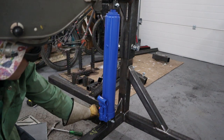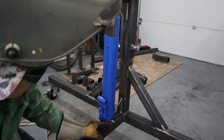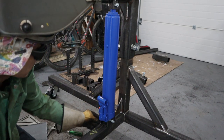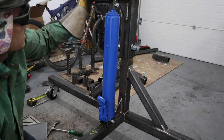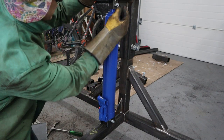I would suggest leaving these bolts in while you weld these, because doing all this welding, you're gonna wanna pull the plate out. Same with this side, right? We'll weld this out, put plenty of passes there, and then you can go ahead and weld this all around. Just watch out you don't get any splatter on your threading. So I'll throw another nut there just to protect it.